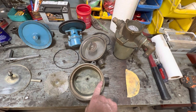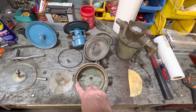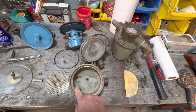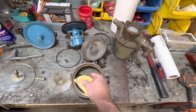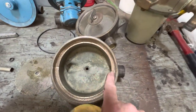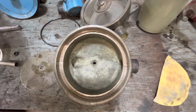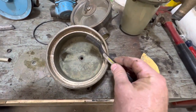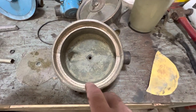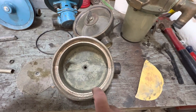Also maybe on this side, that way whenever you put your strainer lid on with your gasket it won't suck air in those areas. Mine was actually just a little bump, so I took some sandpaper and sanded those down flush with the rest of the surface. Then I just took a wire brush and wire-brushed the living daylights out of it, making sure it's super clean so we've got a really nice seating surface for the gasket.